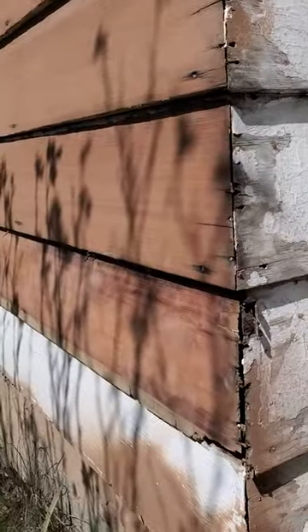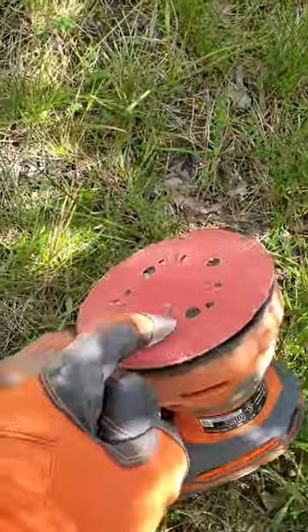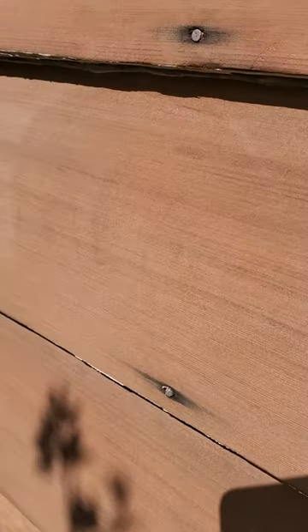You do that, and it's going to make some divots in the wood. Then you get yourself an orbital sander, and I use 40 grit to sand it out nice and smooth. You can see how smooth that is — it's still dusty and everything, it doesn't look as pretty as it's going to get, but that's what you want.